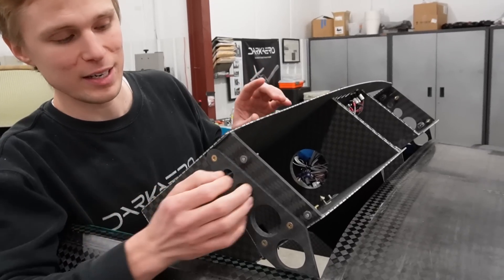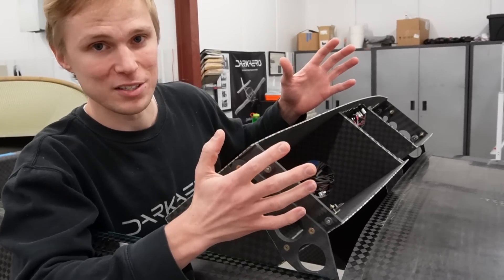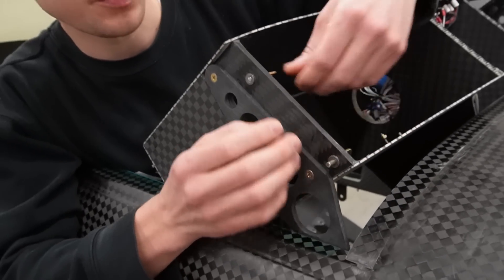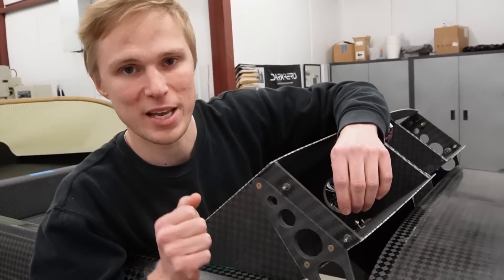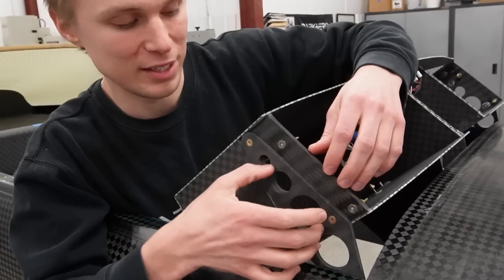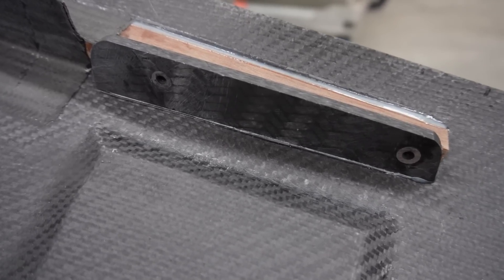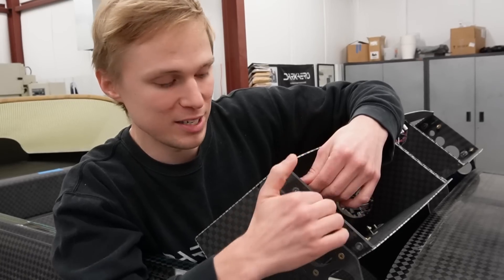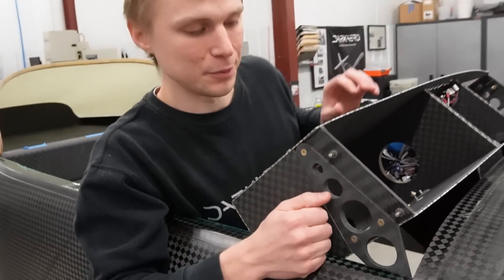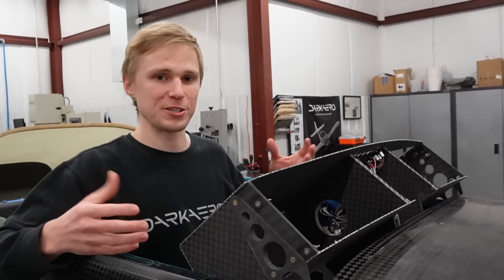The last thing I want to talk about is the way the canopy can release from the rest of the panel in the event of servicing or an emergency — through these pins here. These pins will later be hooked up to a release mechanism accessible from inside the cockpit. The basic idea is that we have the hinge broken into two halves: a lower half which attaches to the panel and the rest of the airframe, and a top half which attaches into the canopy frame. When it comes in it interlocks, and then these pins engage with it so everything is locked together.